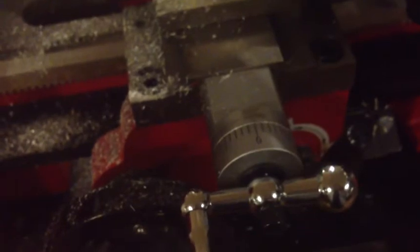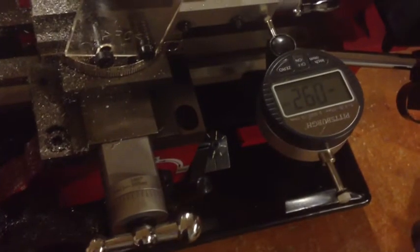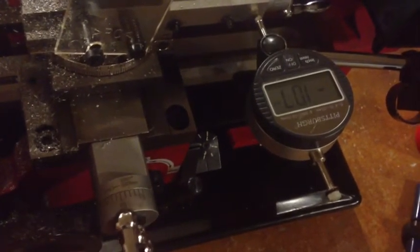What made me think about what to do next, if I ever encounter this again, is I've noticed there's probably about five notches of backlash in the actual lead screws on this machine. So I came up with a solution: I've attached a machinist dial — a digital one I got from Harbor Freight as well — with its magnetic base. The magnetic base is actually just hanging on to this tailstock. What this does is give me an accurate readout. So if I go back and forth, you see it's not really affecting anything — that's the backlash. But once it's caught, it actually gives me a pretty good readout.